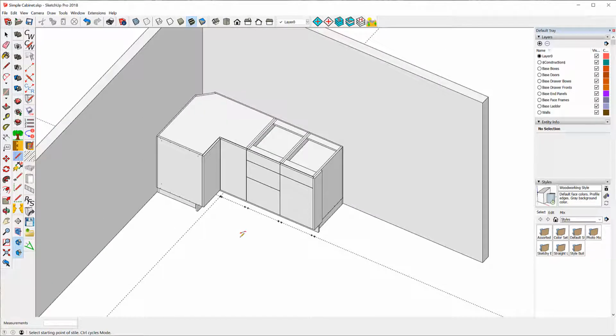Okay, so this was the right opening, and we've got that. This was a connector. The reason you use a left pivot connector is you might want to put another cabinet right next to it. So if I want to put another cabinet right next to it, butting up against this one, where do I start my story stick?